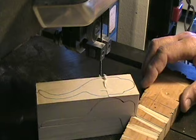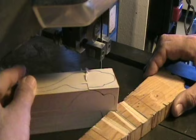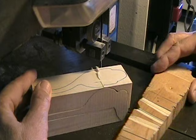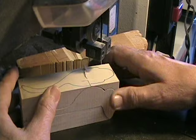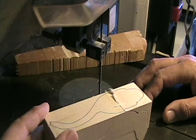The reason is because I can use it with that corner as a pusher to get around the corner and keep my fingers really far away — this is what's going to be doing the manipulating for me. I have just as much control with this push stick as I would with my hand, and obviously I wouldn't want to put my hand in — especially when you're coming to the end of something where you could drag right into the blade.